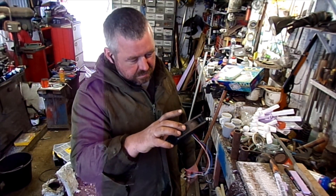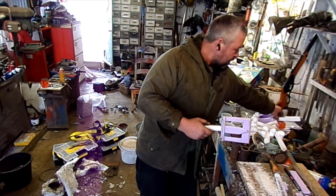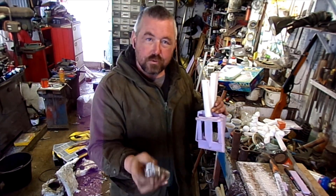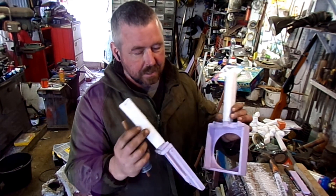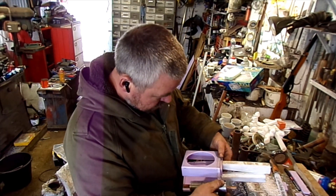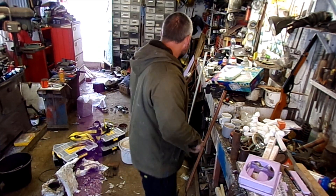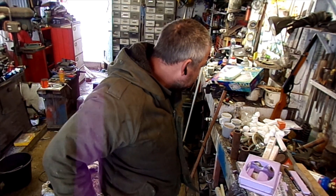Let's see how the others go. I wanted to cool these heat exchangers with a sort of six-inch — or five-inch, 120mm — computer fan. I got a bit carried away last night, and seeing as I've got two flat sections on the end, I thought we'd clamp them or something. We'll get decent heat transfer through the contact, so the box might as well be involved in the cooling as well. Lost foam is kind of handy for this sort of thing — I really should have tried lost-foaming the heat exchangers, but until I get a vacuum on my casting setup that won't end too well with thin stuff.